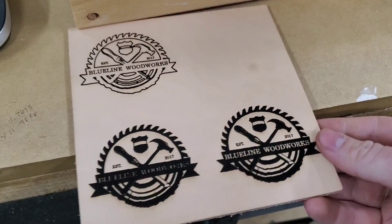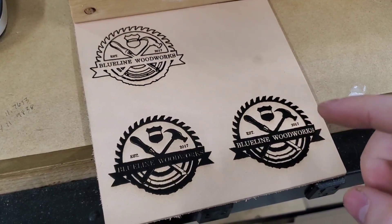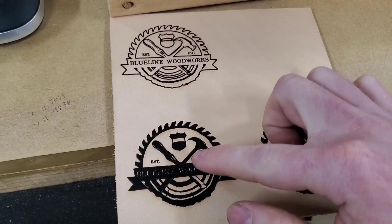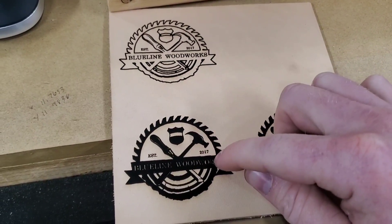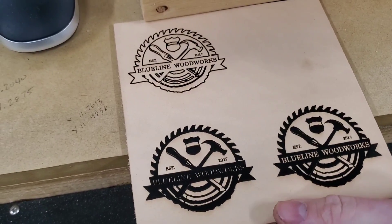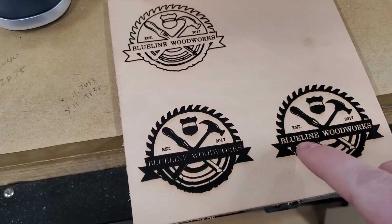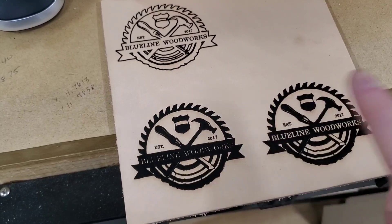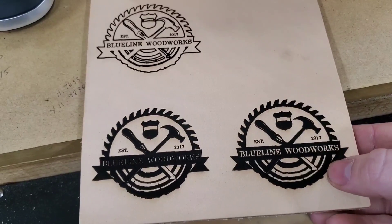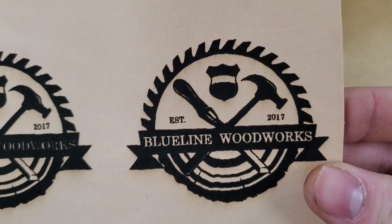Here are the three test pieces. Everything was engraved at 60 inches per minute at 100% power with the 4.2 watt laser. When I initially did these two, I liked the look a lot more, but as you can see the letters are very hard to read. So all I did in Lightburn was put a slight offset on the letters to make them bigger and then turned over scanning off. When I engraved this one — still 60 inches per minute at 100% power, over scanning off — as you can see, that is pretty good right there.